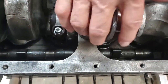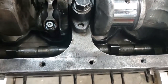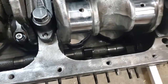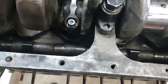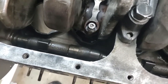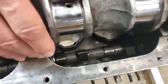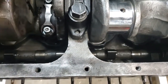Down on this side of the engine you'll see the camshaft — I'm pointing down there and you can see the various cam lobes. You have a bearing here, here, here, and one in the very back, a total of four bearings. They get progressively smaller in size, largest at the front and smallest at the back. When you're putting the camshaft in, you can have up to three-thousandths clearance. Your camshaft needs to be carefully rotated and put in so you don't damage the bearings as you put it in — you gradually slide it in.